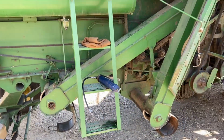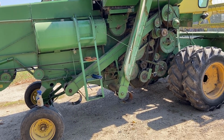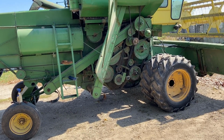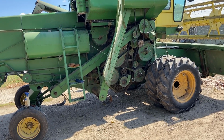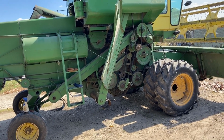And at this point, I just cleaned the air filter assembly. I'm gonna put that back together. And of course there was a big mouse nest in there. There always is. And chains and belts, most of the chains and belts look good. I do need to oil them, but I'm gonna get the machine running first. Before I run this machine, I make sure everything's greased, so I'm gonna hit the final grease points yet. And in just a little bit, I'm gonna fire it up.